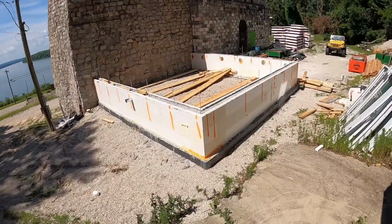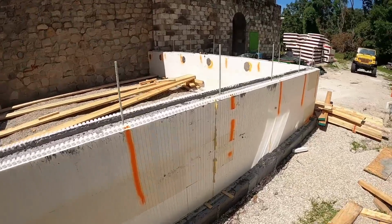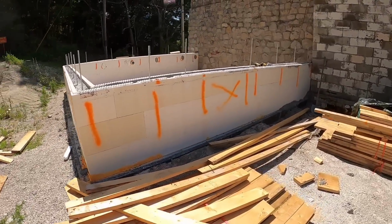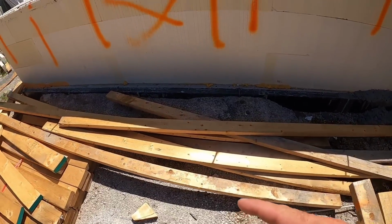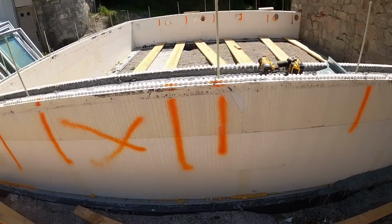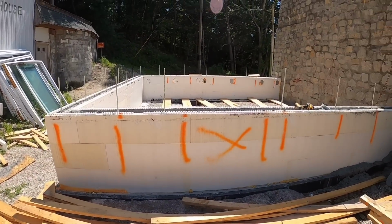Well, there you have it. We got all of the stiffeners and straps and crutches pulled off. We have clean walls now. You guys saw me every once in a while there on time lapse get the Sawzall. I am using Torx head, but sometimes they don't want to back themselves out of the wood, but they'll back themselves out of the plastic studs. So every once in a while you got to cut them off, because I'm going to reuse these boards multiple times, so I don't want to cut the boards or anything. But she is clean. Now we got to get the print out and determine how this layout starts.